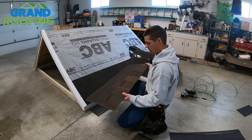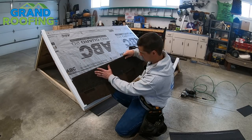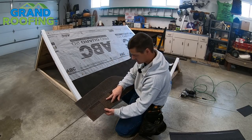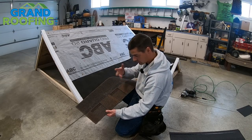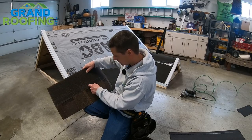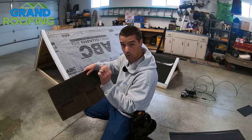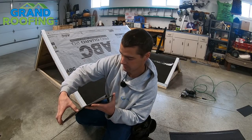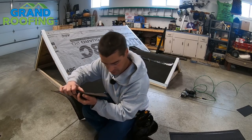Some quick basic terminology of the shingle — it's a dimensional architectural shingle, also called a build-up. This is the headlap, this is the exposure or reveal, the dragon's tooth or sawtooth, the laminate, the back, the shin or wedge. The most important thing: most manufacturers are going to have a nail line here — you need to hit within that line. Some lower-end brands have one line, that's where you need to hit. There's a common bond right here that's pretty small — that's all there is.